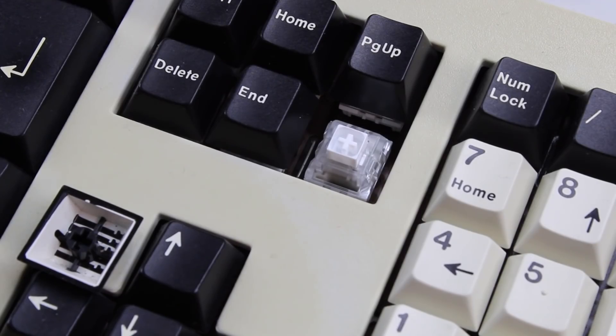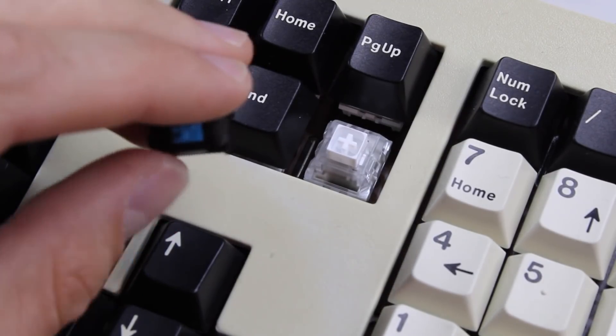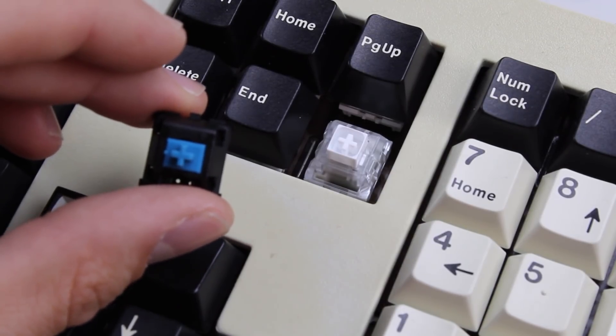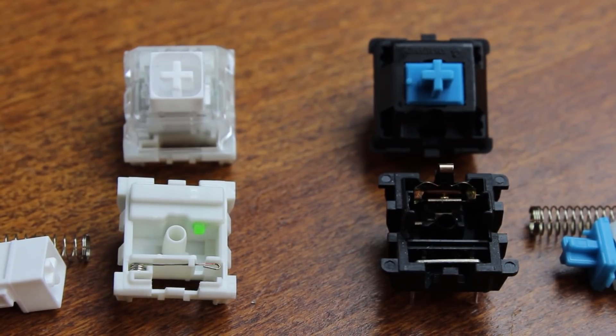Once you've stuck them into your keyboard of choice, it becomes apparent that these are quite different from more usual modern clicky switches such as Cherry MX Blue, which will be the main thing I'll contrast them to in this video. There are really two major differences that the box switch brings to the table. The first is this box-like enclosure around the contact terminals, which I've been told makes the switch water and dust-proofed to IP56 standards — the PCB and other electronics probably won't be, so they'll be more like dust and water resistant rather than fully proof.